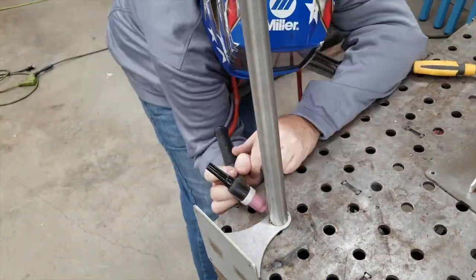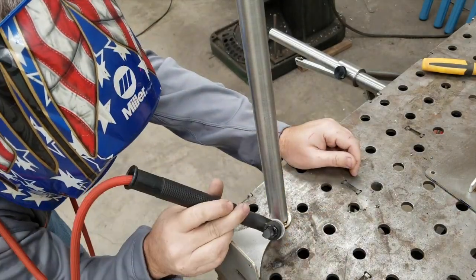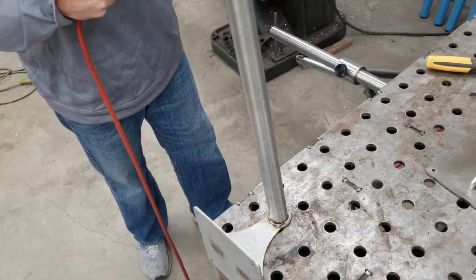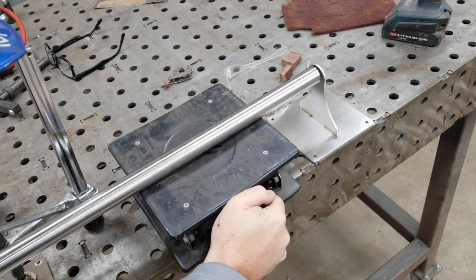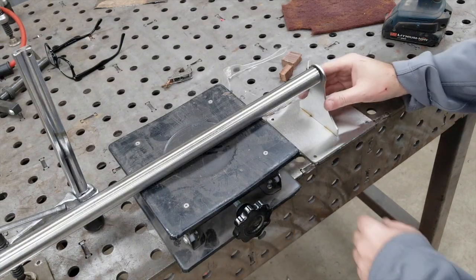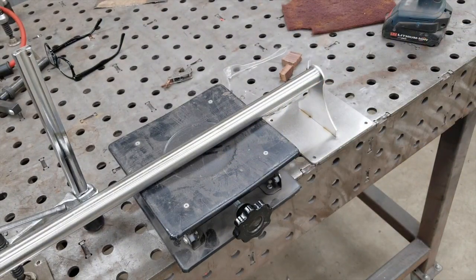Here's the crossbar rod — I'm welding one side to the bracket laying flat and just tweaking the settings a little. It's been quite a while since I've welded; it's something you really should do on a regular basis. I'm using a lab jack here — if you're interested I'll put a link in the description on Amazon, they're about 20 bucks and really handy for dialing in a precise height to get something fitted up. Just getting this square and level and getting it welded on the other side.